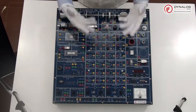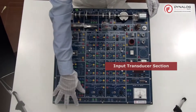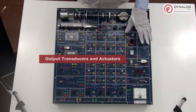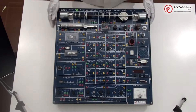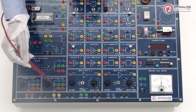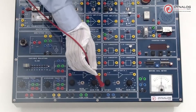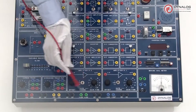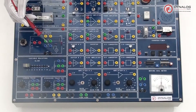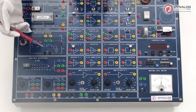Dyna TNIT can be further classified into four sections: power supply section, input transducers section, signal conditioning section, and output transducers and actuators. At the bottom of the board is the power supply section, which consists of +5V, -5V, +12V, and -12V with all ground pins common, along with a 3.5 ampere current rating. This section is used to provide different voltages to perform various experiments.